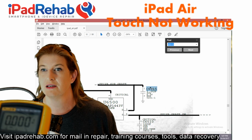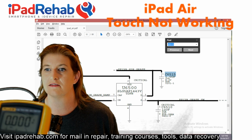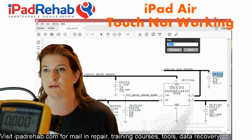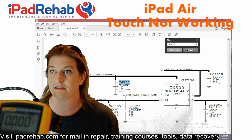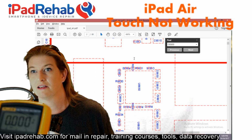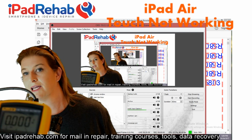So what does that mean? That means this rail is present, but it's not coming through this chip and appearing out here. So that's kind of a problem. So why is that? So let's see whether or not this chip is actually connected to power itself. So let's find C6500 and see if we have VCC main grape on C6500 or not. So let's go on a hunt for that, find it. And hey, it's right in the same spot. So there's C6500. That's our power into this chip. So let's go and measure it.